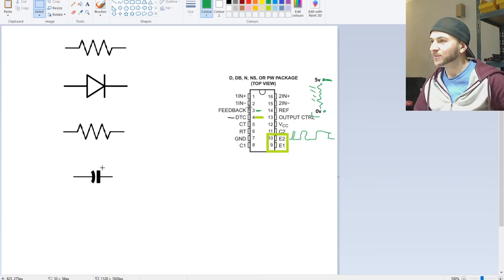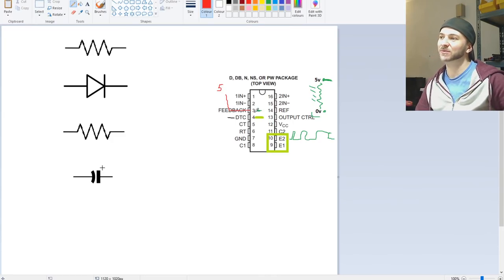So on pin number 3, we have a supply of 5 volts to start with, and then it goes to ground. So let's draw that in first. In phase 1, we have 5 volts coming in here, and then it eventually goes to ground when the amplifier turns on. So let's take the pre-startup phase to begin with. The second that you apply the remote to the amplifier, 5 volts is sent to pin 3 to put the amplifier into disable mode, into shutdown mode. And then when it's ready to turn on, it goes to 0 volts.